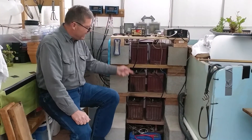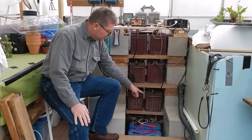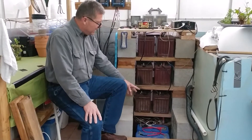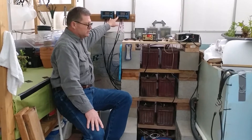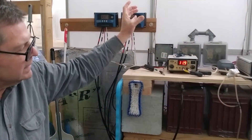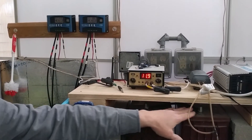Okay, we're back inside the greenhouse. I wanted to show you this bank of batteries. You can see that we have eight of these red Trojan batteries. These two are my batteries for the trolling motor in our boat — we just have them in here piggybacked on it right now to keep them charged. But the main power for our system comes through this charge controller and these two charge controllers, coming in from the solar panels to these. These three bring the arrays together and they're joined back here in the back in a main lug on the batteries.